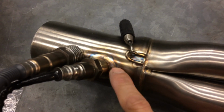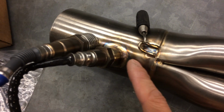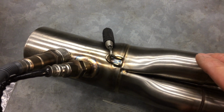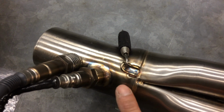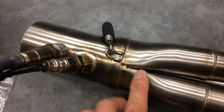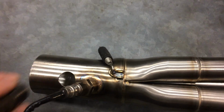When you look at the coloring on stainless, and actually any type of steel, these are tempering colors. Once you get to that bluish color, you're at about 800 degrees. When it goes above 800 degrees, steel, doesn't matter what type of steel it is, won't have any more color. It turns gray between 800 degrees and 1,200 degrees. So these are the oxidized colors. Basically, at those temperatures, it's being exposed to air, the surface gets oxidized, and that's what the colors are. We call them tempering colors. Once it gets above 800, that goes away, it turns gray until about 1,200 degrees or so, 1,250. That's when it will start having color again, but not oxidizing colors. It will actually glow, with a dull glow at first. As it gets hotter, it gets brighter and brighter.